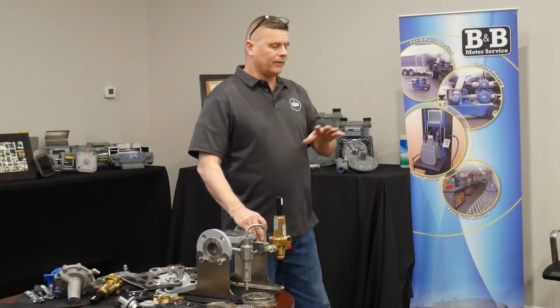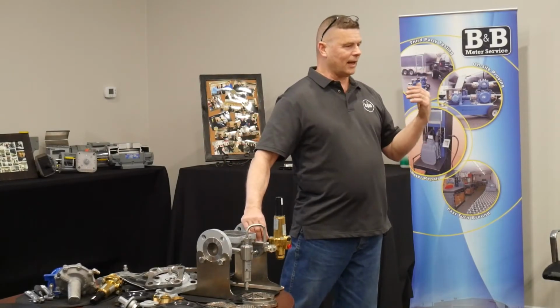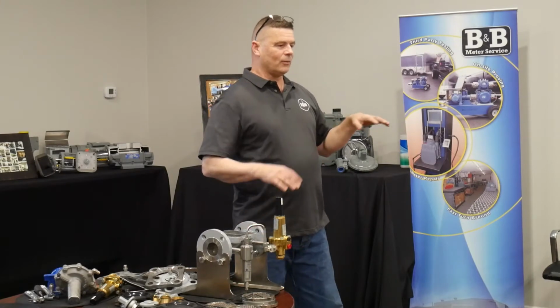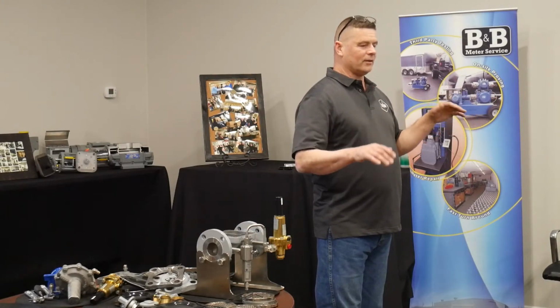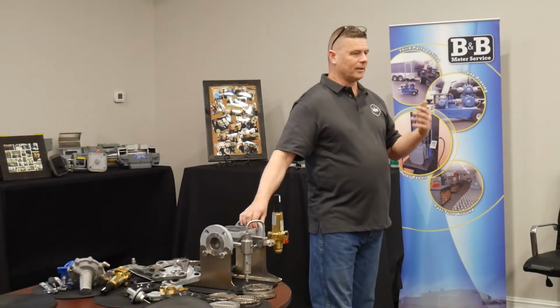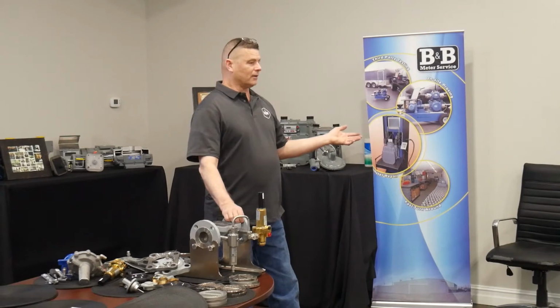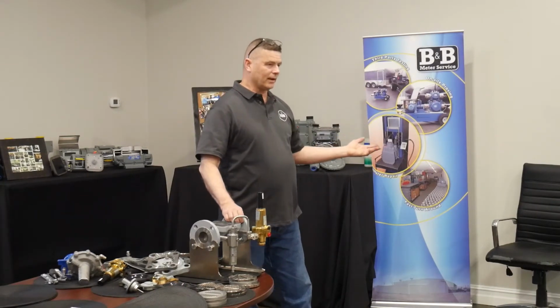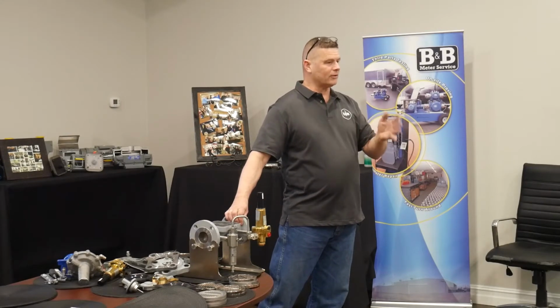Think of all the various systems out there. Some of them are making massive pressure cuts with a lot of velocity, and there's a lot of wear on the soft goods. And then you have other ones that are just sitting there making a relatively modest cut, not huge changes in volume. City Gate Station example. It might be able to just sit there and hum along for years and years before you'd have to do anything to them. So we leave that to the customers to decide, but they need to inspect them annually.